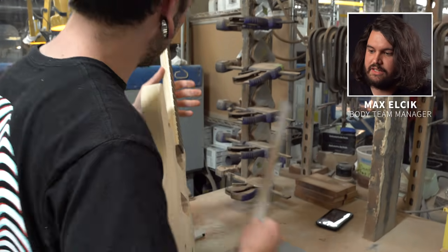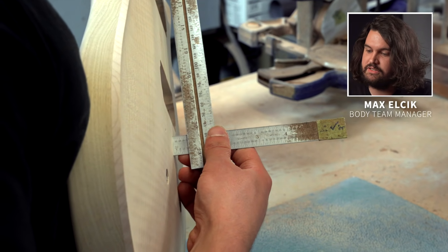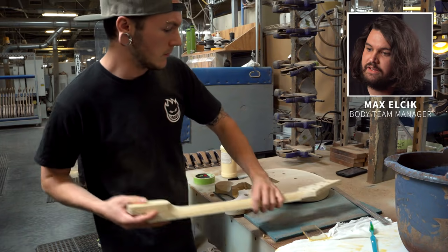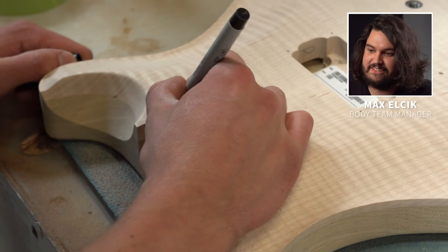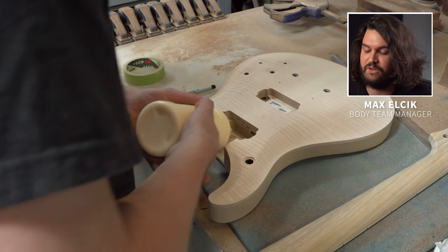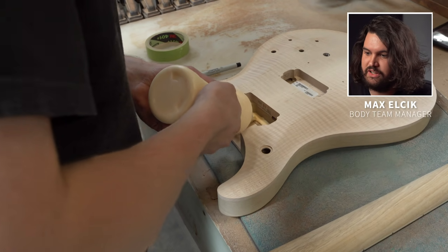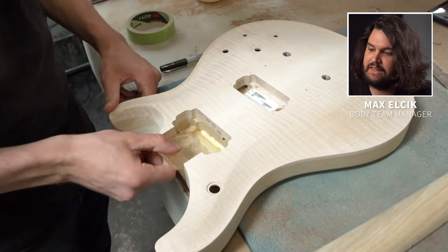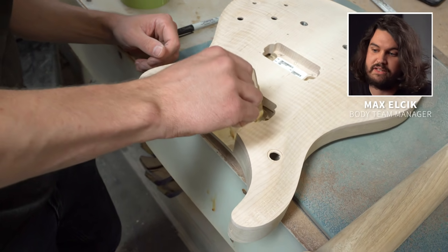Once Jack is done cutting the heel, Sam is going to pick up the next step. He is going to be building the guitar for us — gluing it up and clamping it, making sure everything is set right. The first thing he does is double-check Jack's work to make sure it's all in line. These guys really do a good job, and part of that is holding each one accountable. All three of them work as a really nice team here. If it checks out, he moves on to spreading glue inside the neck pocket, with a nice even layer on the bottom, left, and right sides of the neck pocket, and some glue spread on the heel of the neck itself as well.